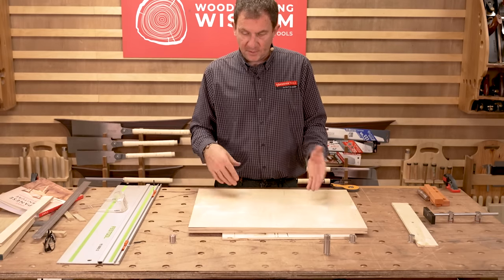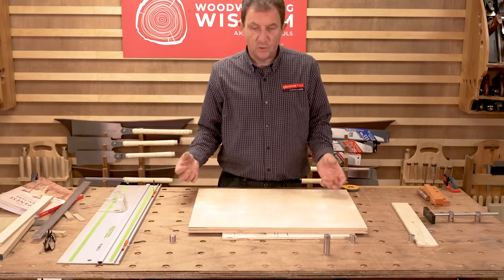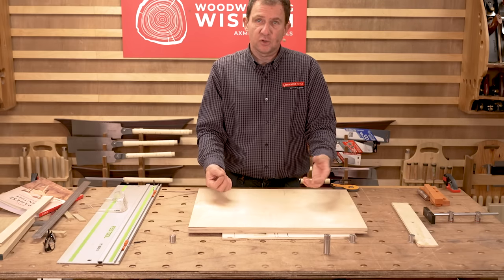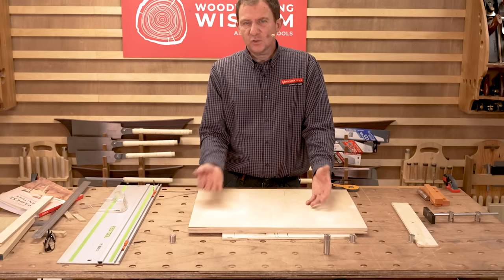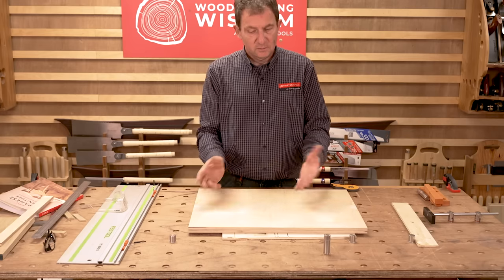I need to look at the plan a little bit. We've got to measure off that to work out exactly where the angle shape of this thing is. But if I screw down the corners, I can hold them together whilst I cut it. That's a beneficial thing. I've also got the handle to cut out. So again, I might be able to use that position to screw it together to hold it. Beneficial, instead of fighting to hold two bits and maybe lots of clamps, could we fix it? The corners are going to get cut off anyway. So that can be good.